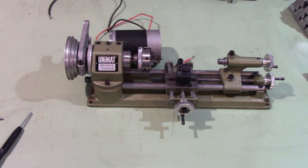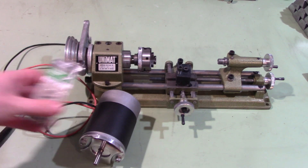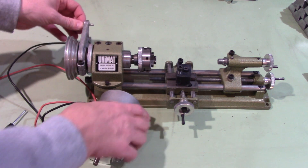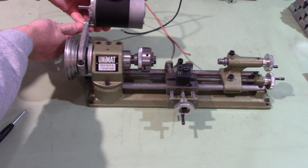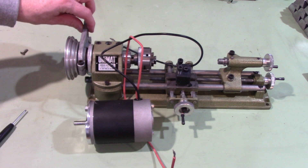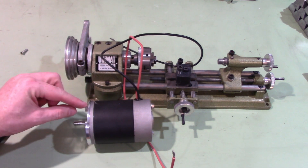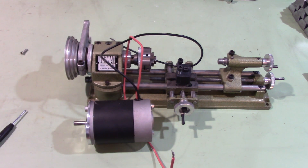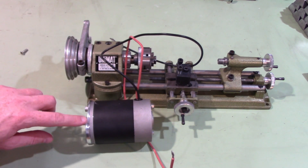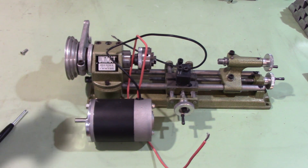Hey guys, it's actually been a few weeks since I made this motor bracket. I think where I left off is I was going to go buy some screws from the hardware store. So I've got some of these — they are 10-24 by 3/4 inch, and they fit really nicely into the motor mount. We'll have to trim a little bit off. The next size down was half inch and that would have been too short. So I'm going to hold the motor mount up to the lathe, mark where the screws are going to roughly go to make sure I have it aligned properly. This nut is inside that recess in the motor bracket. I'll use my calipers for a more accurate measurement of the distance between the screws, then mark the adapter plate accurately and tap it so we can bolt it on.